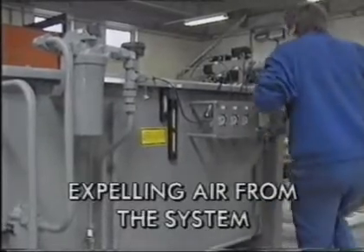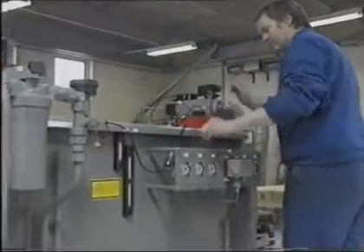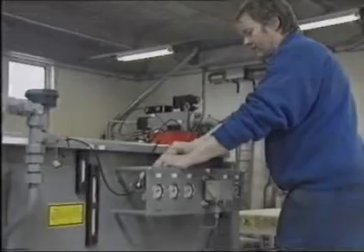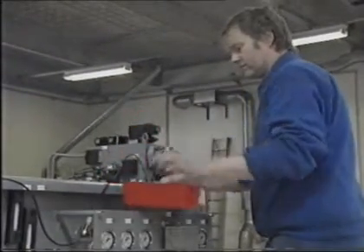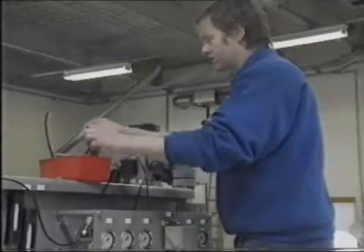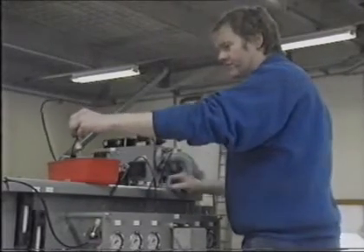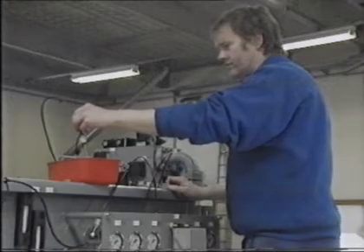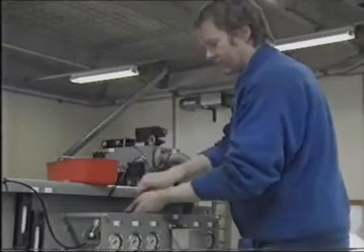Like all hydraulic systems, the removal of air from the system is of vital importance. A useful way of removing air is to employ a hose usually used for measuring pressure. The hose can be fitted to any of the measuring points with the other end of the hose stuck down in a bucket. A very low oil pressure is selected. The absence of air escape noises and a very stable pressure reading on the manometer shows that air has been expelled from the system.